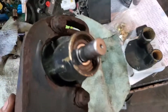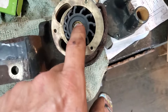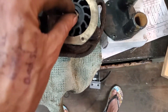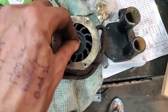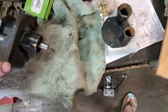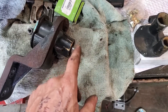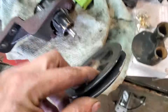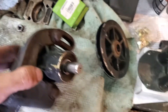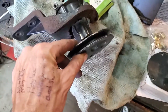When you go to press the pulley back on, you don't want to start pushing the shaft through the bearings. Since the shaft is recessed, what I do is take a little nut and put it in there - it's loose so it won't damage anything, and it sits just above the surface of the housing. Place that on the press so when you press the pulley on you're not pushing the shaft through the bearings and messing up the alignment. Don't forget that snap ring - it's important - and don't use junk Chinese bearings. This goes on one way. Thank you for watching.